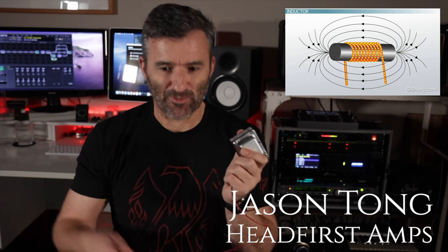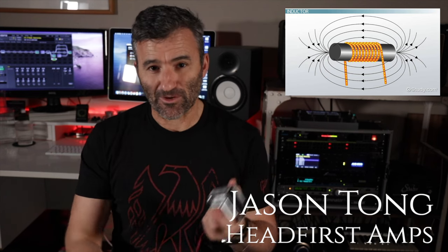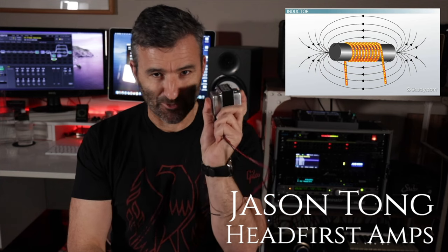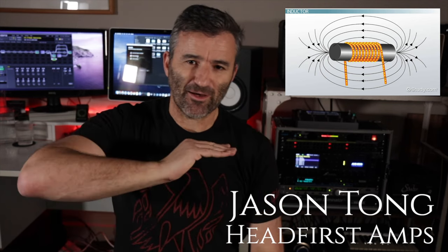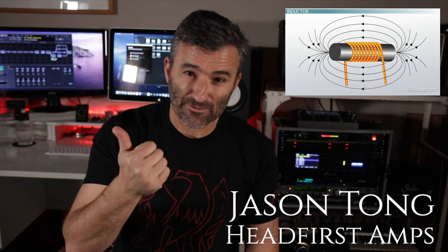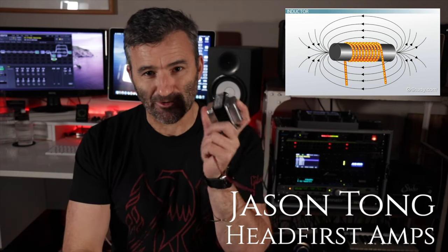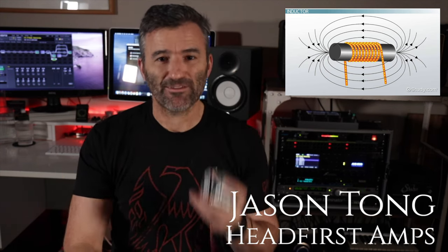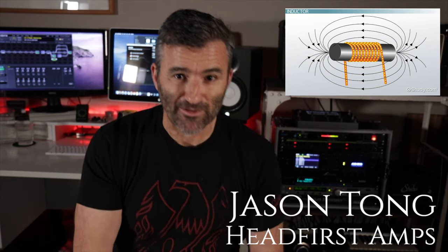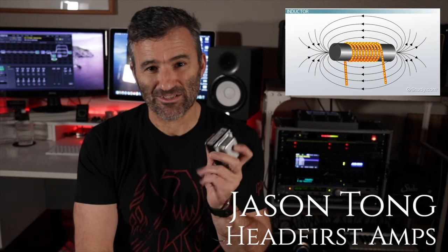So as soon as you plug your mains in, it goes through the power transformer, it gets rectified, it gets filtered with filter caps. The very next thing that happens, it'll go through the choke, right? And so as it passes through and creates a screen supply line, supply for your phase inverter tube and the rest of the preamp tubes, the filter choke is doing its job to repel the AC and you get a nice steady DC line.